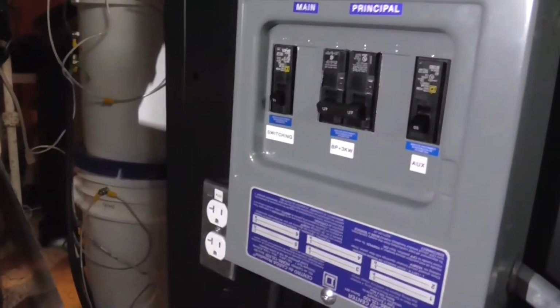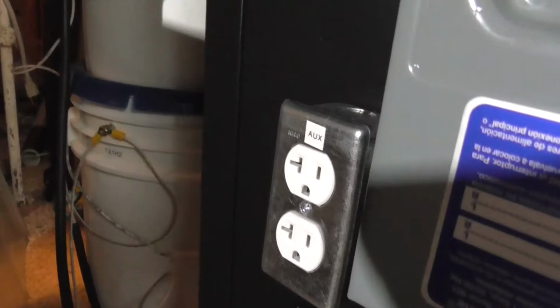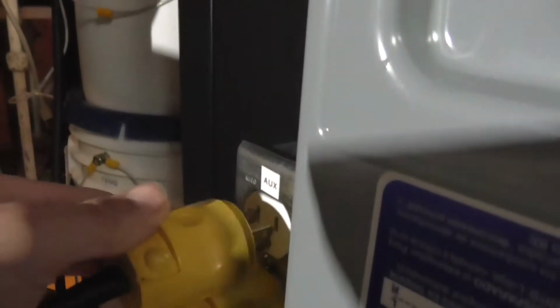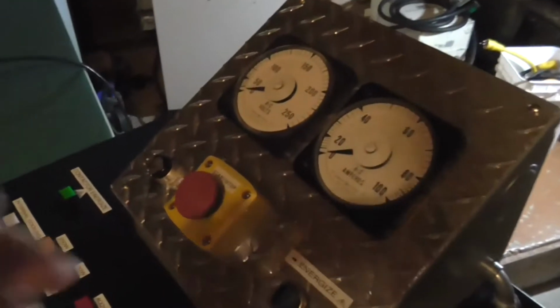Okay, so our auxiliary power supply will be these two transformer stacks that will current limit our setup to 4,000 watts on the auxiliary selection. So let's plug those in. Breakers are on, and we've got our power block plugged in there. Now we're just going to plug in our potential transformer because we haven't used it in a while. So let's power that thing up and test it with the potential transformer. Now that we're ready, let's turn it on.